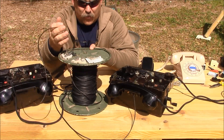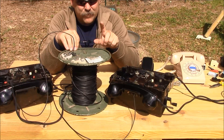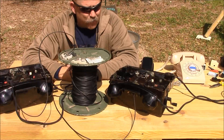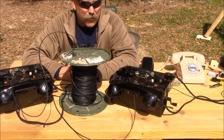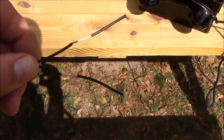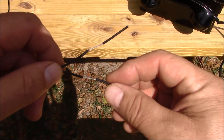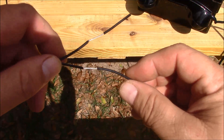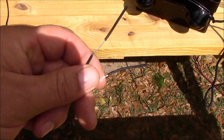The conductor connecting our two stations together is WD-1A wire. I've made several videos making antennas out of this wire — it's good field telephone wire, it's fair antenna wire too, it's inexpensive and extremely durable. When working with this wire, always leave some of the insulation on the ends, because this stuff does prick you rather badly, and it also gives you a nice guide when working with these binding posts.